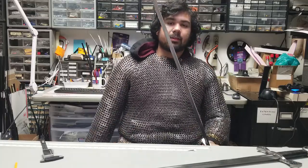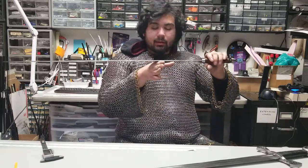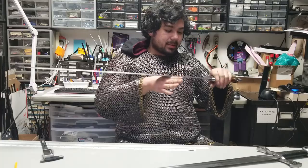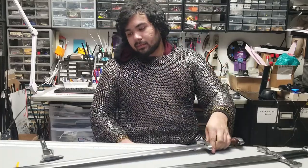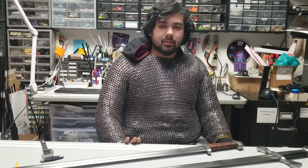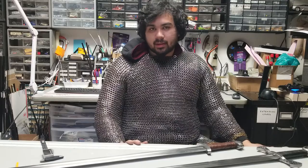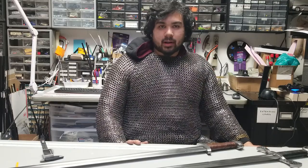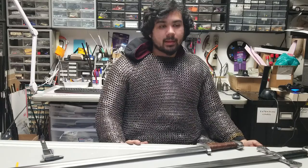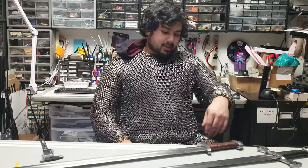It does have a slightly heavier blade compared to some later medieval designs. Because of that, the balance point is going to be a little bit closer to the tip — this one is roughly 5 to 5½ inches. Really bad reproductions have 8 and 9-inch balance points. I'm not saying that never happened historically, but when you see that the vast majority of blades are balanced a certain way, they're constructed with that ideal for a reason. You need a weapon to perform, and if it's too clunky, it's going to get you killed.